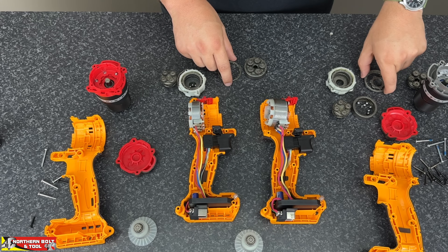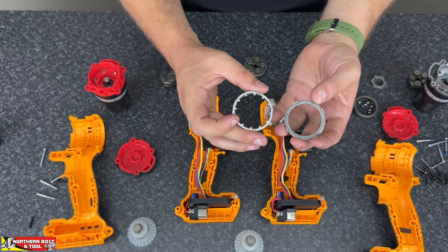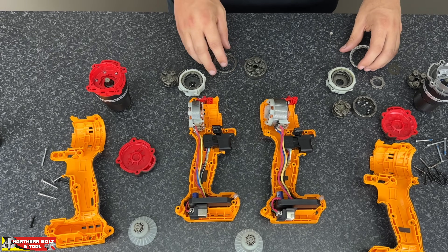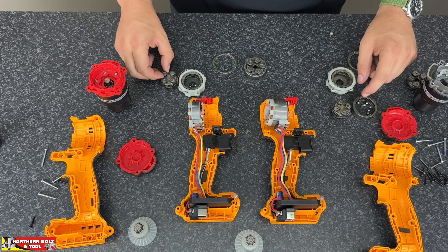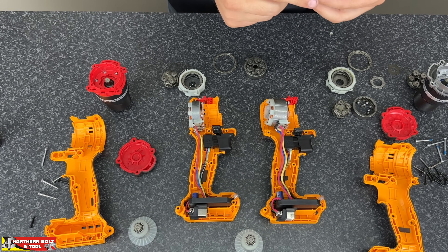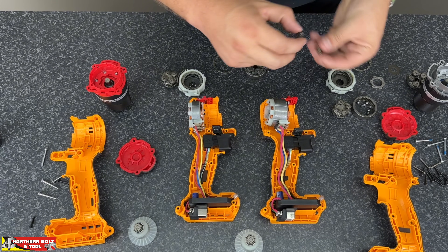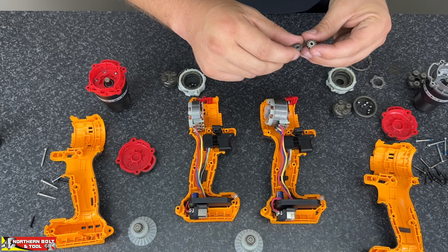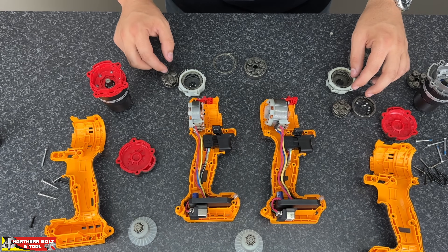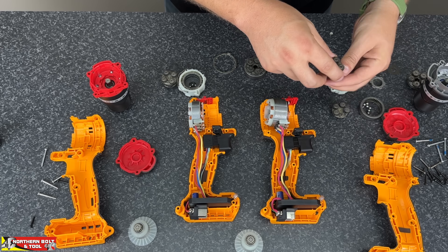In terms of the gearboxes, the outer ring on the 96 newton meter machine is a lot more heavy duty than on the 66 newton meter machine — obviously designed to take a little bit more work and abuse. In terms of the rest of the gears, everything appears to be pretty much the same. The gears have very similar markings, which leads me to believe they may be interchangeable. Although looking at the smaller ones, the ones from the 66 look kind of different — slightly different markings and slightly different colors. I'm not well versed enough to tell you exactly what that means, but maybe there's some heat treatment going on.